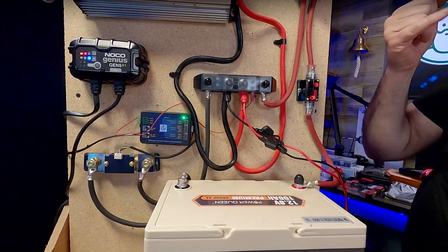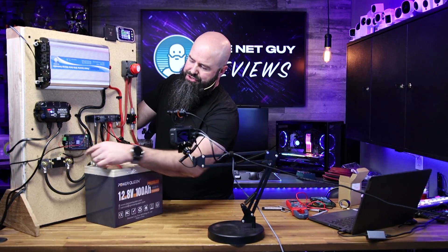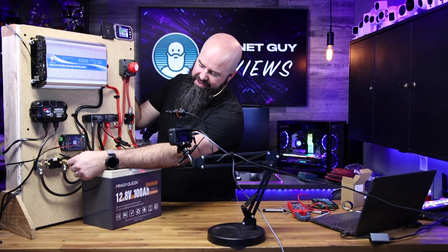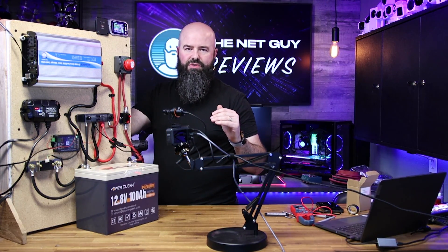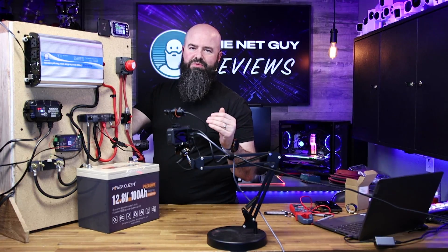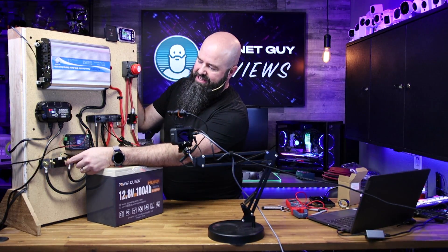There's a little nick in the metal to calibrate the resistance. Once they know the resistance of that metal, they measure from both sides of this very low resistance resistor to figure out the voltage drop before and after the resistance. That voltage drop, with all the fancy math, turns into current.